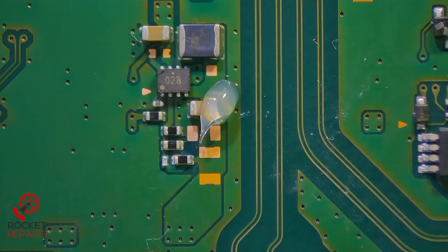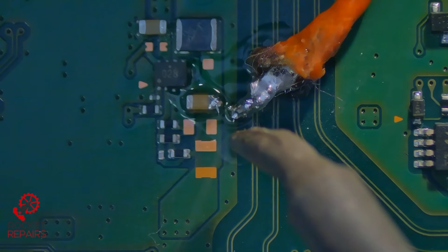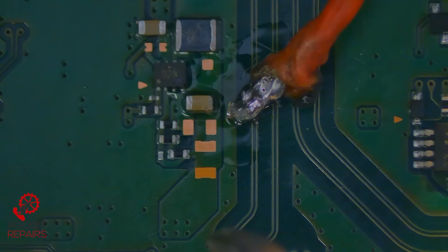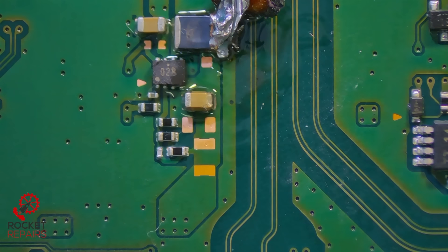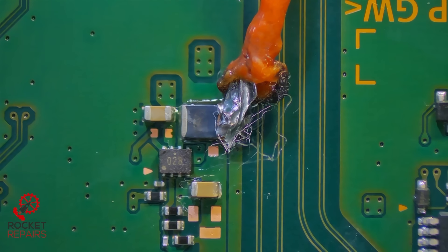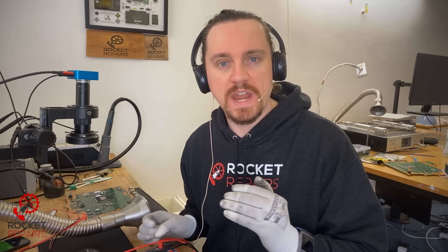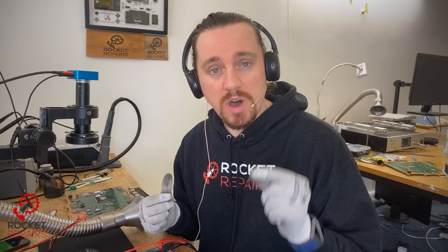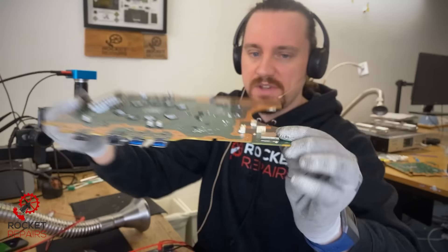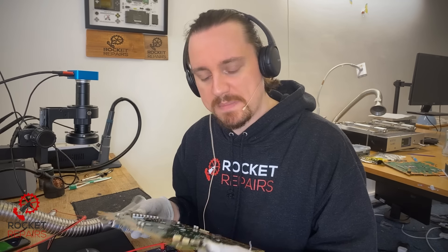We add a tiny bit of flux, take our iron, add some leaded solder, then take our wire and quickly put them together. We're going to inject one volt starting to see what happens — 700 milliamps, which should be more than enough. I wasn't actually getting anything at one volt, one amp. Even though I was drawing 700 milliamps, nothing was getting hot. However, at two volts it drew about 1.17 amps and it showed the Wi-Fi IC getting very, very hot — which is this thing right here. So I'm going to remove it off the board and hopefully that relieves our short. If so, we re-ball one, put it back on and see if it works.